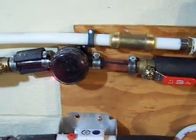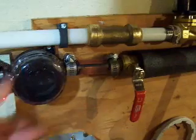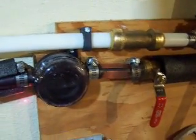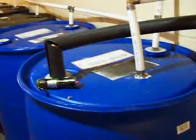In order to clean the basket filter, I usually hit this shut off valve, put it in the off position — this one is not really necessary to turn off but you can if you want to. Then you go ahead and just unscrew this. Inside you'll see there is actually some plant and roofing material that does filter through the rain reserve. The rain reserve itself does a good job at filtering, but you want to make sure you catch all the debris. Don't just feed it right into a barrel — you'll have debris start to build up in your barrel, which is not ideal.